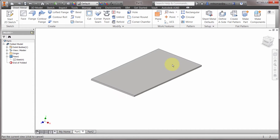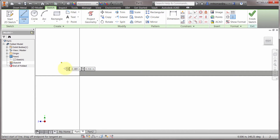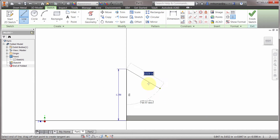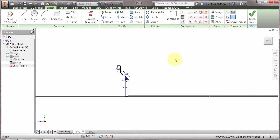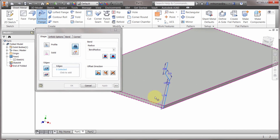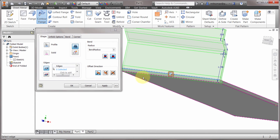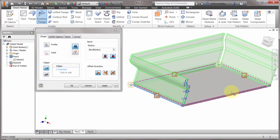In this case I've already got an existing face, so I'm going to sketch on this face here. Let's create a new sketch and do the same process. I'm going to go up 1.25 inches, then add an angle — 0.625 at 130 degrees — then a small tab of 0.5. I've created the geometry for how I want that to look. Now going back to the feature, let's use the same contour flange. This is my profile, and I want it to follow this edge — let me pick those two edges.